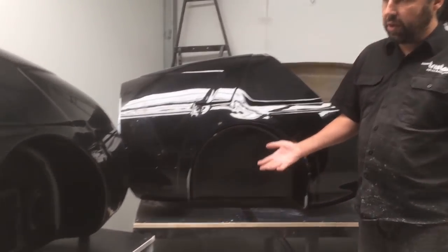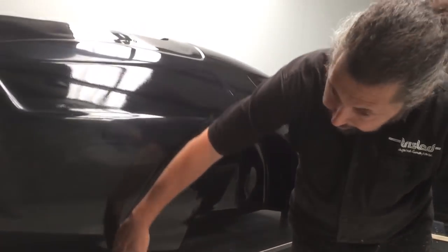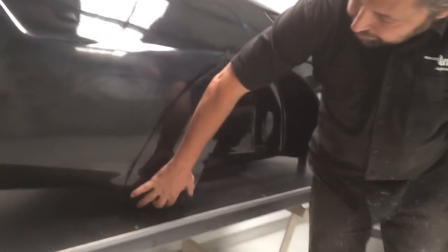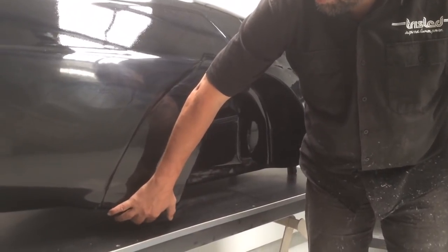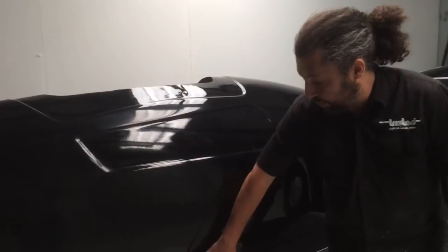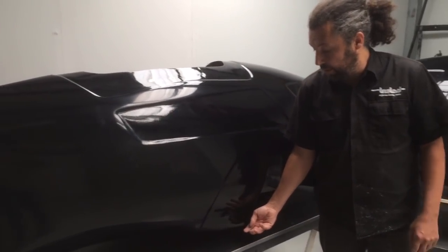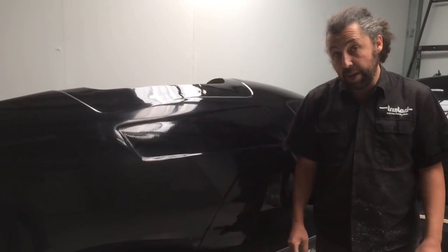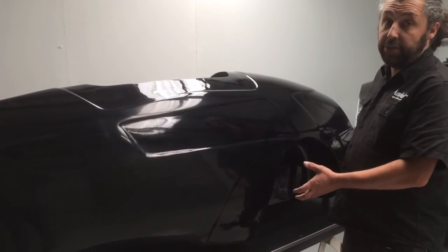The obvious change in the Aquila 3 pattern is that the nose cone bond goes much further back now, and that means we get both the cell and the nose cone and the glue which is holding the two together all in this region — lots of material. This means that when the shell gets older after a couple of seasons, hopefully most of the damage sustained from crashes is going to be all in the nose cone, which is the replaceable element.